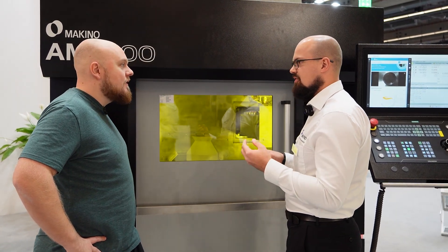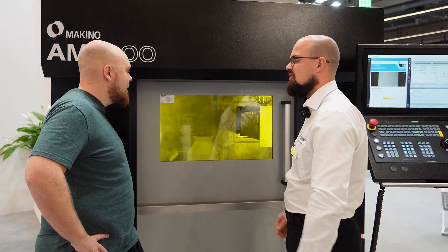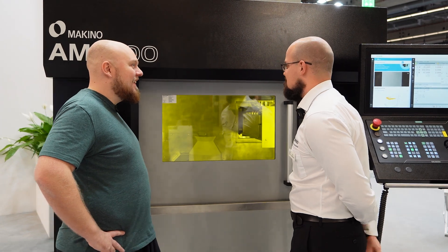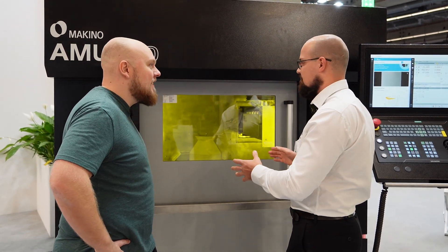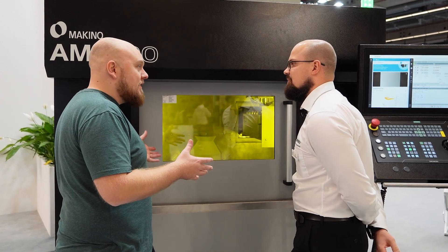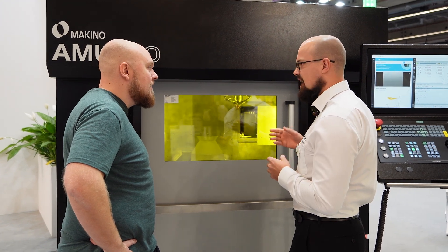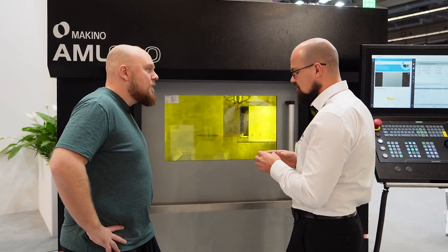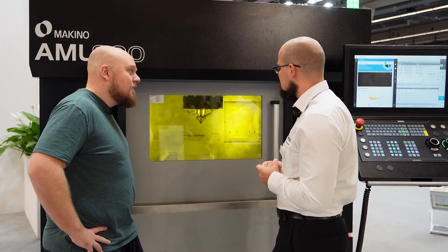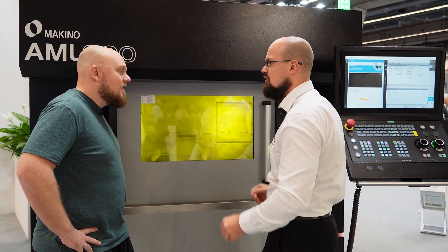So before it really comes to a defect that is not repairable, we just replace the nozzle and continue with a fresh nozzle. So you have covered all bases to get it as successful as possible. That's our dream and vision — to be able to fully automate this and make it robust, documented and fully clear. Are you using some kind of camera system to check things? Yes, we have a lot of integrated sensors. We have a camera to monitor the laser spot and the melt pool in the process. We have a pyrometer to measure the melt pool temperature. We have sensors to measure the powder mass flow and the shielding gas.